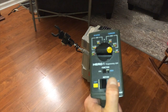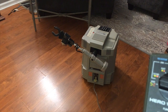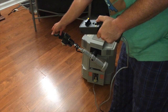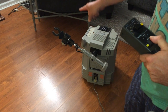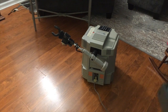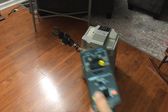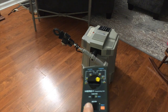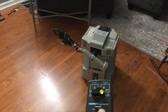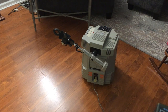Then you have the grip. Use your ear if you're doing arm functions — you've got to really pay attention, because you can overgrip. You'll hear this telltale sound. Say you're picking up a cup — hear that click-click? You've basically lost your zero. See how now it's not closing all the way? You really have to pay attention. If it tries to overdrive, the motor will slip — there's some protection to keep things from breaking. Once it's slipped, you've now lost zero. A quick way to regain zero is to run it out max in one direction. You hear when it stops — now you're kind of back at the zero point. That works for the gripper function. The other alternative is to hit command 32, though that won't actually reset it if it's hit a limit. But that's a quick way to figure out the clamper limit.